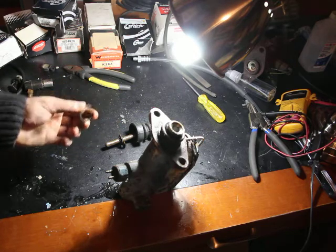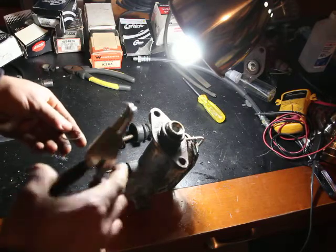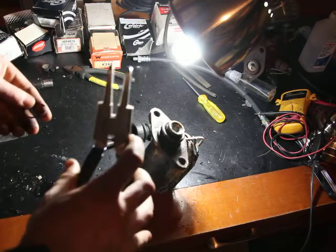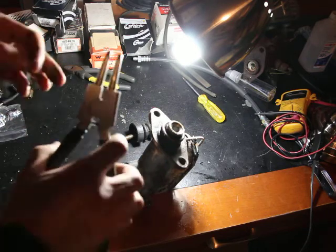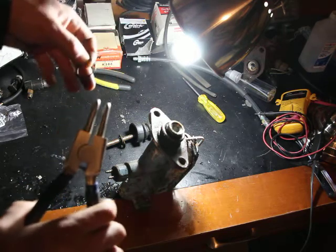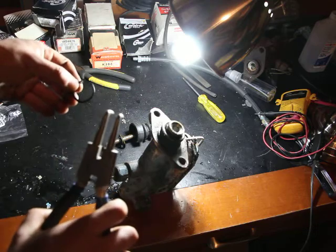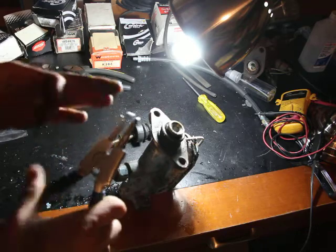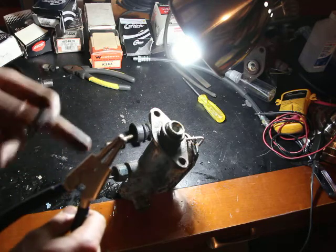But the snap ring — the holes — I have a snap ring removal tool. This is one for outer snap rings. So when I press on it, it opens apart. The other one is the inverse of this. For inner snap rings you want it to close, so when you press it, it actually closes instead of opens. So this is normally closed, the other one is normally open.